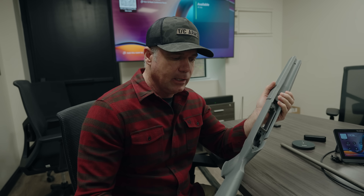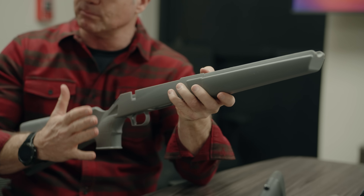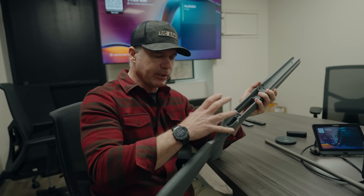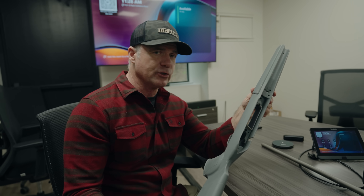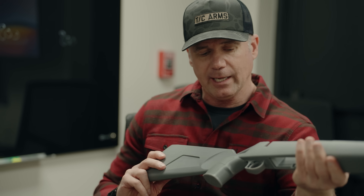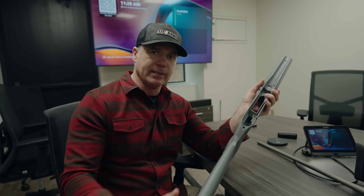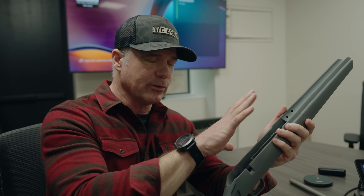Stock design is one of the arts of gun making. You can do a lot of models on a computer screen, but at the end of the day you really have to have a solid model you can put your hands on and make those small aesthetic changes. Back in the old days, we'd take a piece of wood and start whittling — take a rasp, take Bondo, and create shapes by filing and filling. Now with CAD design and SolidWorks, you can do a lot on screen, which helps with geometry and manufacturability. But printing it out, having this 3D model in your hands, is the only way to go. This is Gen 1 — we'll probably end up with Gen 3 before we lock in the mold design. What the team at Aviant has going on here is pretty groundbreaking, and I promise this will be one of the most impressive stock designs you've ever seen.